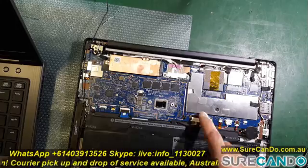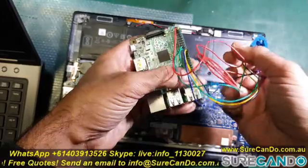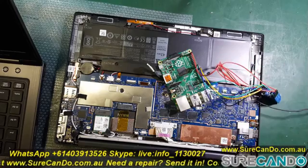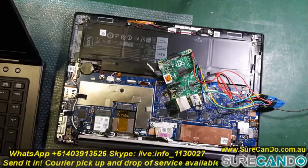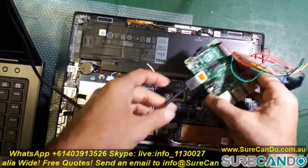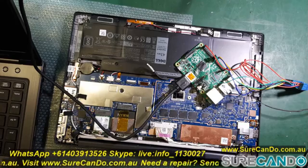I use a Raspberry Pi for my BIOS chip programming, and here is me trying to connect the Raspberry Pi with the 8-pin connector to the wrong chip. The BIOS chip on this motherboard is actually a 16 megabyte chip, and I was trying to connect to the 4 megabyte Winbond chip, which was the incorrect chip. With my first go I did manage to identify the chip and started dumping the old data across, which was an incredibly good feeling, but I knew something wasn't right because everything worked smoothly without any problems. Usually to me it means I'm doing something wrong.